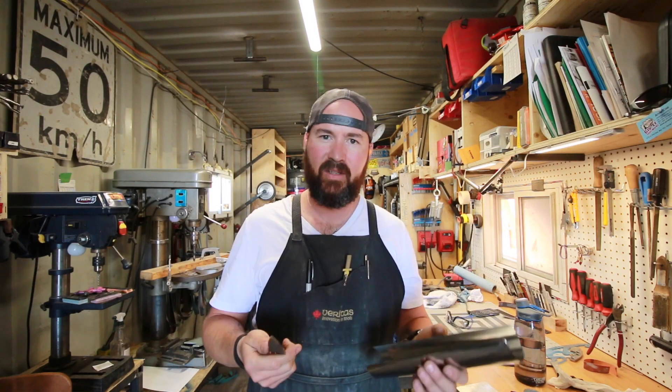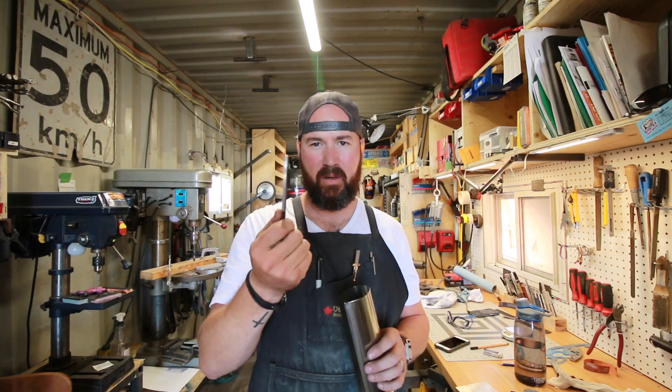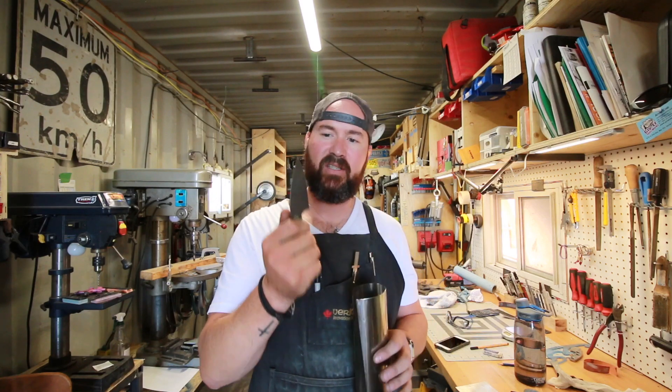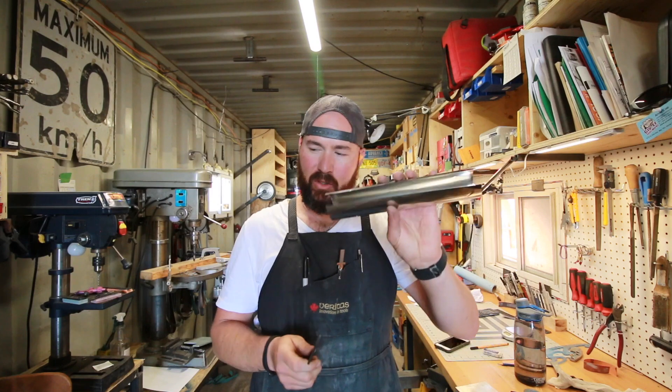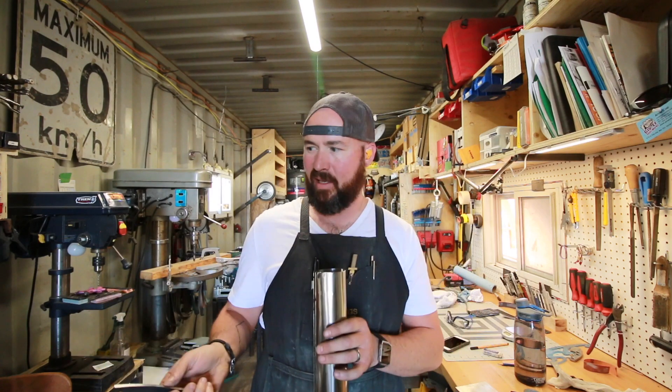That's really important when you're getting up to super high temperatures. If you're heat treating tool steel you might go up to 1450 and not leave it too long, but for the amount of time this stays at 1920 degrees, that's quite a while and we definitely want to maintain the integrity of the steel. We're going to make that pouch right now. The kiln is at 1400 right now, so we better get this going.